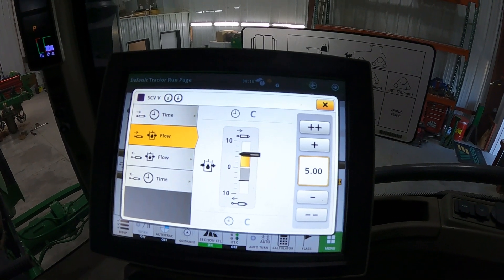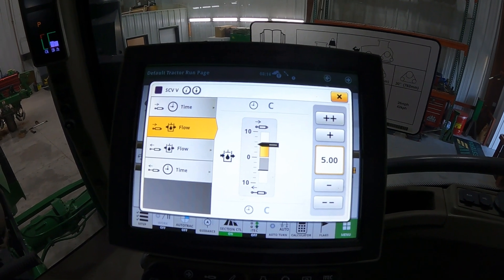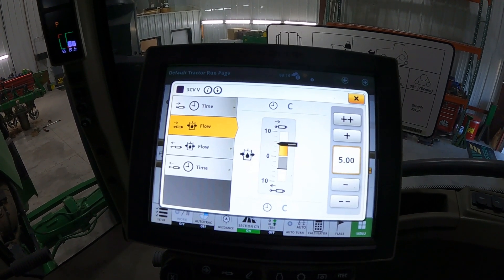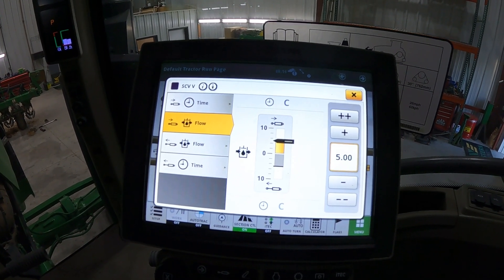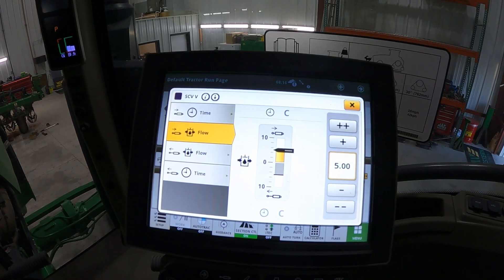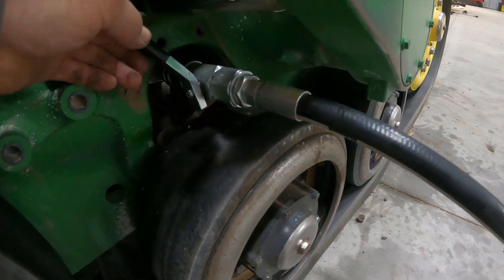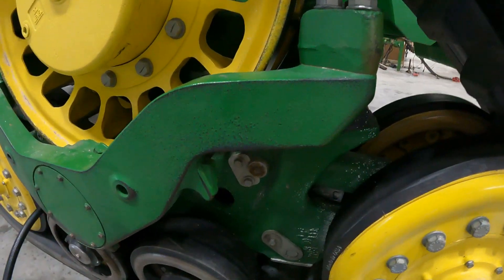Right about a minute. While it's in flow and in constant, we're going to exit the tractor and then go down and turn off our valve that we've made on the end of our hose to tension these tracks. We're going to close that lever off while it has pressure on it - that's how it releases both ends of that coupling and holds the pressure on the track tension. We'll shut that off - our track is nice and tight.